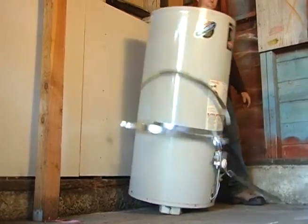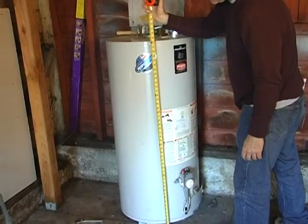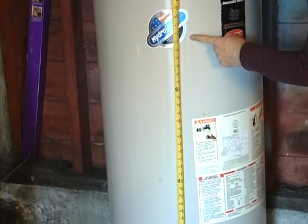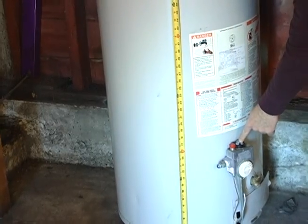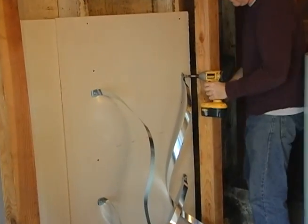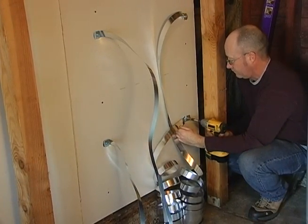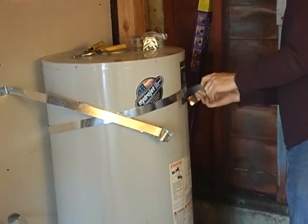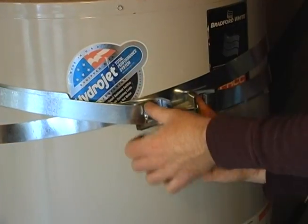Here's what happens when a water heater is fastened to something that is not structural. You need to position the straps so there's one in the top third of the tank and one in the bottom third, at least approximately. The lower strap must be high enough to be over the top of the water heater controls. Measure the tank first to position the straps. Now, do the same for the other half of the straps and for the second set of straps. Now you're ready to secure the straps around the tank. Attach the two sides of the straps together with the hardware in the kit, then fasten them tightly.